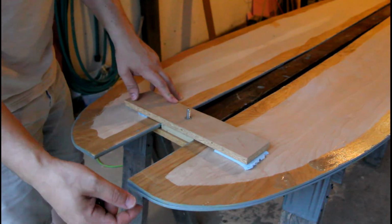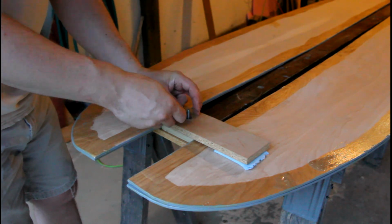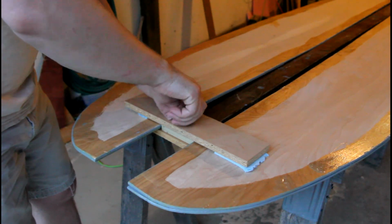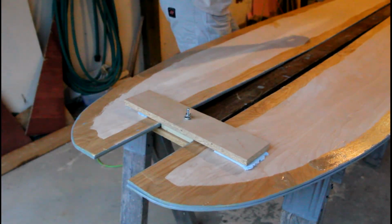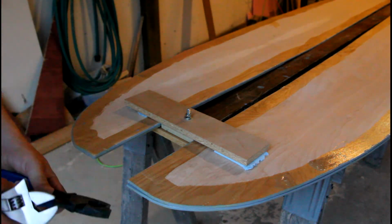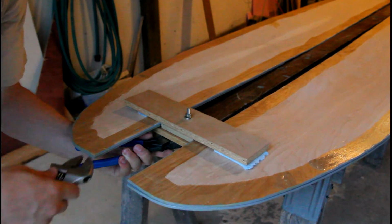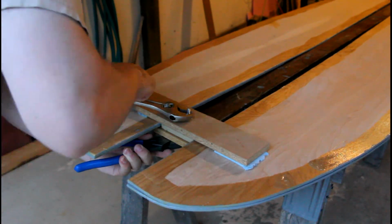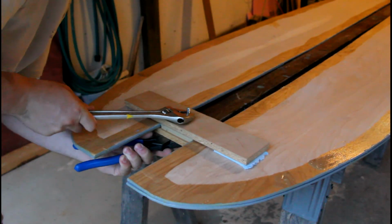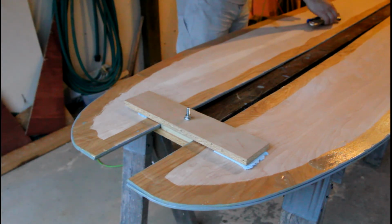But you can pile all of these up into one pile, cut them all at the same time. The contact cement and the painting adds time, but other than that, the time is about the same whether you do 1 boat or 3 boats or 5 boats. If you get too excessive, like about 3 is the most you want to cut with a jigsaw at a time, and skill saw and such. If you go beyond that, then you're doing multiples. But once again, you're still batching the job, and it helps out.